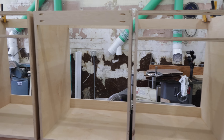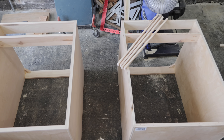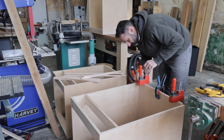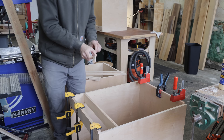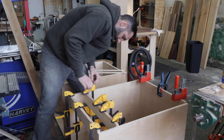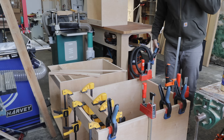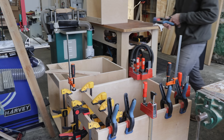I've got these cabinet boxes basically all built, so now we're going to do something to finish them off really nicely. I think this part makes it pretty cool — you take these strips of maple, because I always have leftover scraps and long strips that are otherwise useless, and you just glue them on. We'll go through the process, it's pretty easy. All right, there you go — all clamped up. I need a couple more long pieces for the horizontals, so I'm going to go do that while these dry.